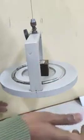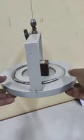Actually this reading for the rectangular block should have been taken before this. Since we have already taken this one, at last we are going to take the measurement for 25 oscillations for this metallic rectangular block. So I have to take this out, and this should be placed exactly in the middle, in such a way that the distance from this end is the same as from the other. The axis of rotation must pass through the center of mass of this rectangular block. If it is not placed properly, you will not get the proper reading, meaning you will get a faulty result. So once again let us rotate it by a very small angle.